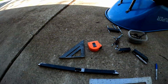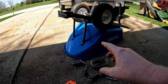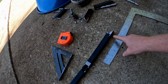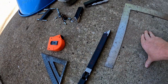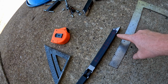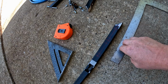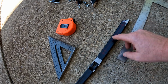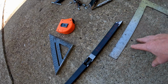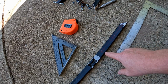All right guys, I've got it all laid out here. Now the distance between the holes there on center is 2 inches. So I made my pieces 3 inches long using my quick squares and my square. I drew a line where I was going to start, cut this off, and then you've got my 3-inch piece, making it 3 inches so I could have my 2 inches on center, right? And I center punched them with my automatic puncher. I recommend one of these guys anytime. That's a Starrett one. Not that it matters what you get, but yeah, I used to work at a machine shop.